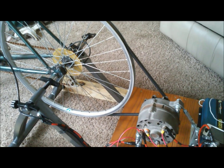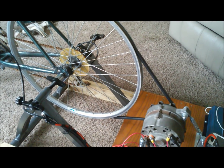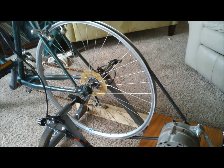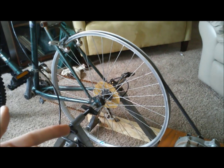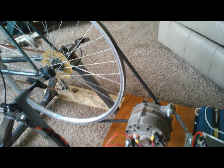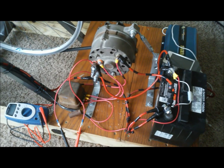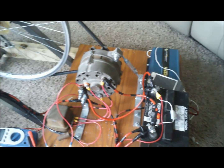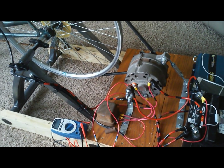You want the bicycle in the tallest gear possible because you want to spin the alternator as fast as you can to create the most voltage. What you do is get the bicycle up to speed and then flip your switch, which kicks on your voltage regulator and sends power to your alternator. Once you do that, there will be a strong load on your bicycle momentarily that you have to overcome. Once you get your RPM up, that load goes away, it's quite a bit easier to pedal, and you're making voltage — we can see that with our multimeter. The wiring looks tricky but that's just because it's this old-school 45-year-old alternator. So I'm going to hop on it, give it a test, and we'll watch it charge at 14 volts.